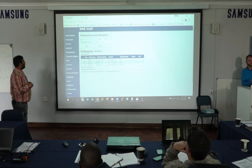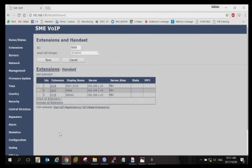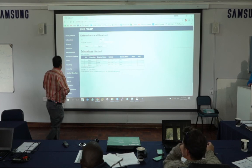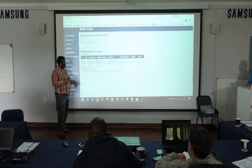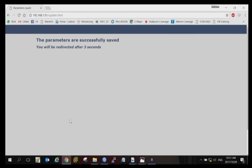Okay, so there's all our three extensions configured now. So now we should be working. Why not? We have to register the handset. You can register one by one if you want, or you can tick all three and say start registration. Okay.